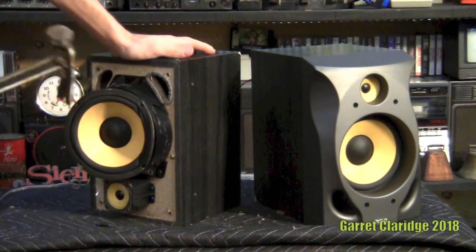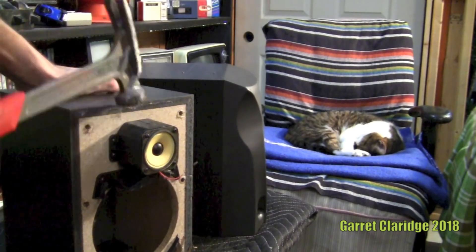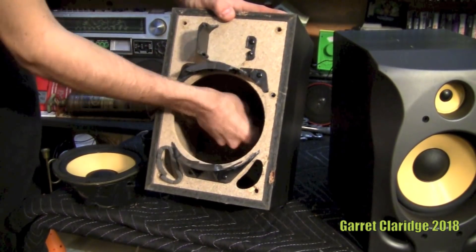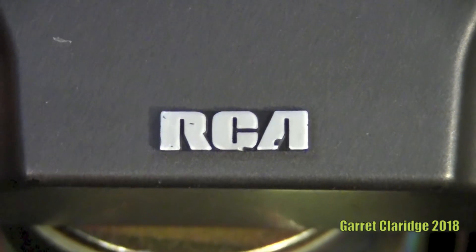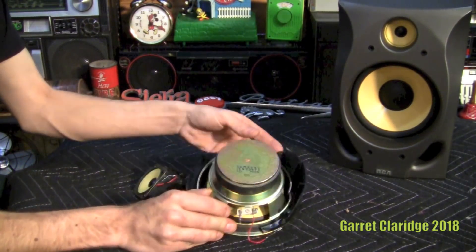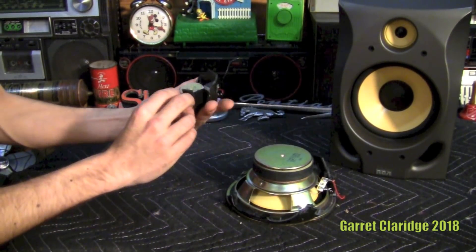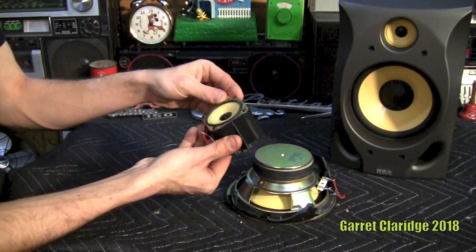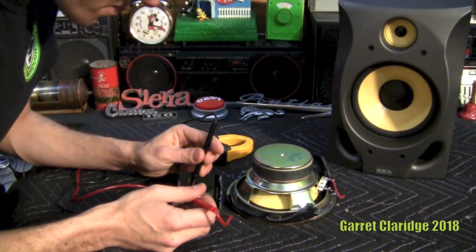Oh, I'm bending it. Not bad. Nothing in the cabinet, no insulation, just a wire. I had to remind myself what brand of speakers I was taking apart, because all the drivers are labeled Samsung. We ended up with some nice-looking drivers — Samsung 100-watt, 6-ohm, 6.5-inch woofers, and also these 2.5-inch tweeters which are also labeled 6-ohm, 100 watts. That's a little weird — they look like the same power. I'm curious if there was a crossover issue or if the tweeter was actually blown.